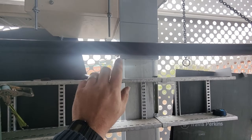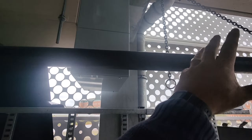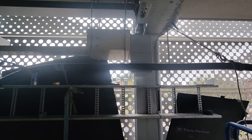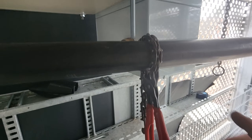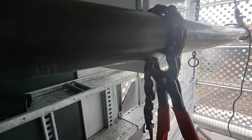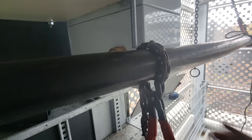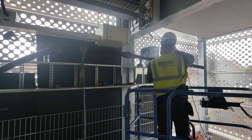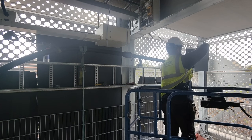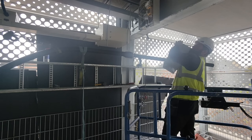I'll strip it to fit the gland, and then I'm not going to bother unsetting all of this - I'm going to unbolt that, take it off, slide it onto the cable, onto the gland, and just connect the lock nut. It's not that easy but that's the stages. I will say about the exhaust cutter - look how tight that is. Hardly any room, you wouldn't be able to get a hacksaw around there, junior hacksaw or anything, and I've just completely ringed that cable. Lemon squeezy, beautiful.